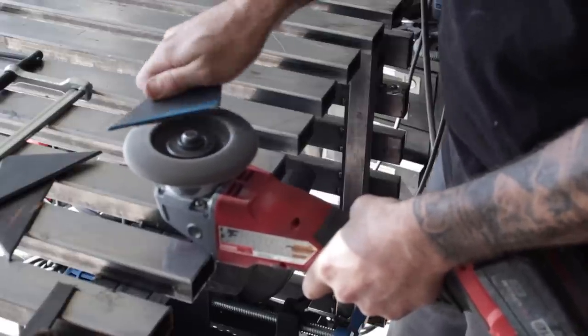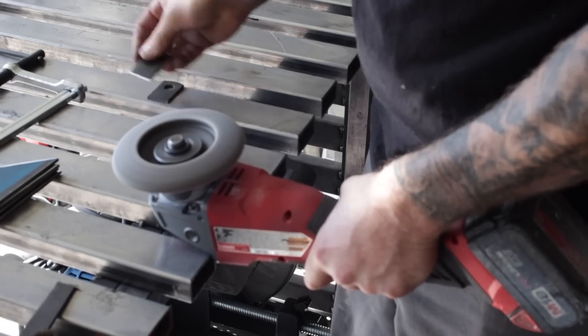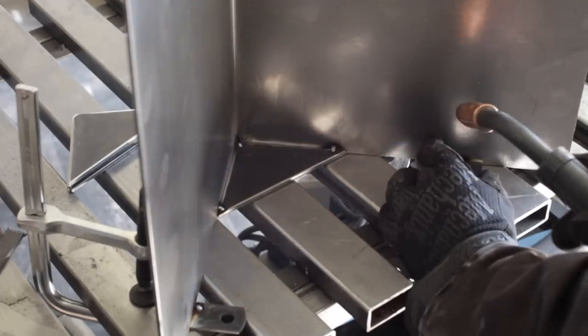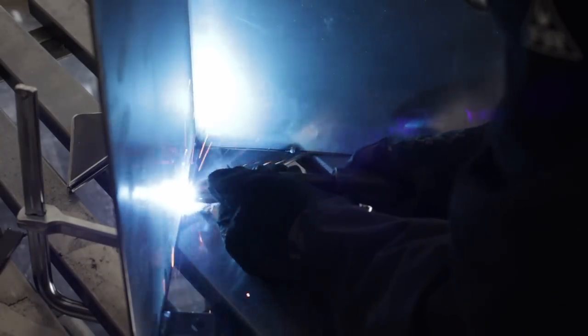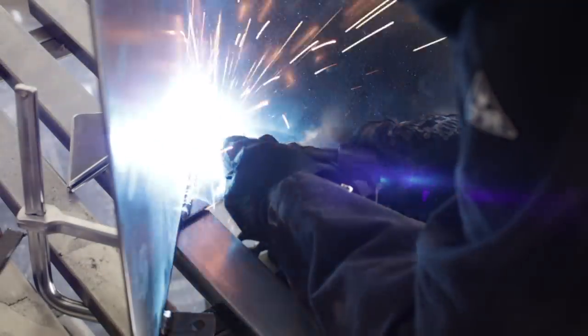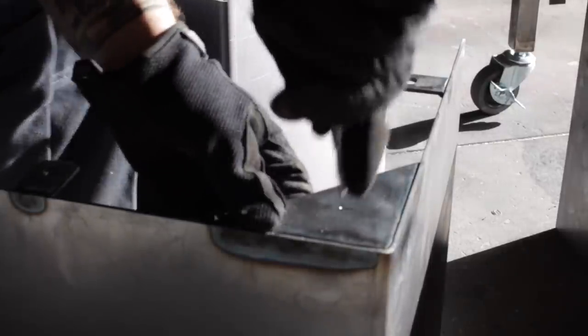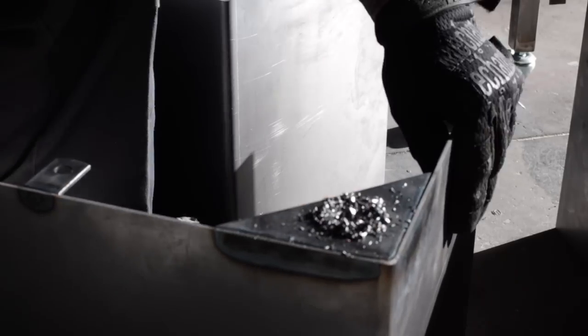Then I moved on to the base build. I ended up using little gussets and tabs, getting them ready to weld into the corners. I wanted a four-leg system that took up a lot of space but still let some light come through the base — since the center was clear frosted, I wanted that light to shine up through so it wouldn't be such a dark top. I ended up using 11-gauge steel from IMS Industrial Metal Supply and had some local sheet metal guys do my 90-degree radius bends. I used 24 by 12 inch pieces bent in half, added two tabs on the corners, and the gussets kept everything square while adding a third hole for extra support.